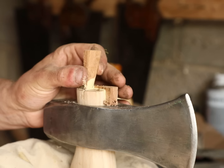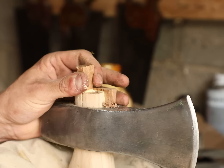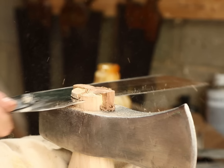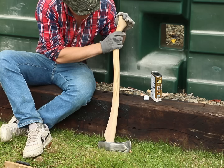I think I might have put the parallel wedge in too tight or too early, because when I tried to put in the two smaller wedges running perpendicular they just would not go in. After a bit of messing around we did get them in a few millimetres, but it was looking fairly ugly. I came at it afterwards with the cross-cut side of the Japanese saw to cut everything nice and flush, then used the Shinto rasp and some sandpaper along with some glue to clean everything up. All in all it wasn't as bad as I thought, but it was far from beautiful — but hey, this is a tool not a decoration, so we'll just drive on with what we have.